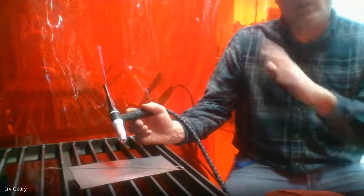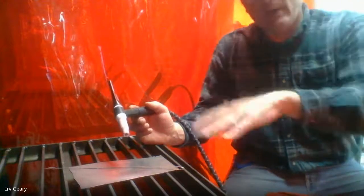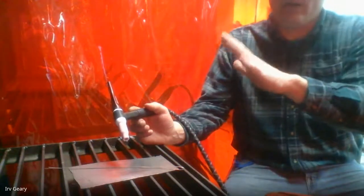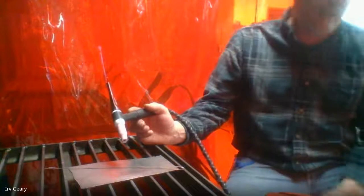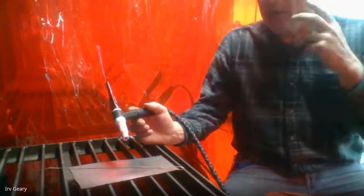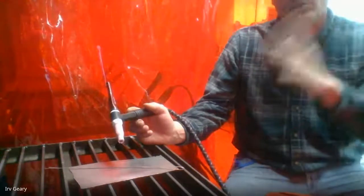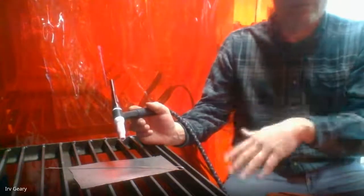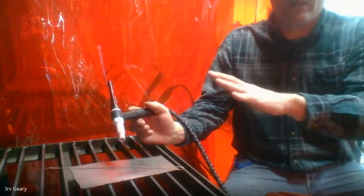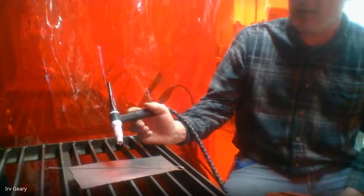The upside is we can control that amperage with the foot pedal. We set the welder to 80 amps wide open — if I want less heat I back off to half throttle or three-quarter throttle and control my puddle size. When you move that pedal up and down you're adjusting the amperage and the frequency at which the amperage comes out. Just remember: more gas equals more heat, less throttle equals less heat, and we let off the pedal all the way to stop — just like a gas pedal on a car.